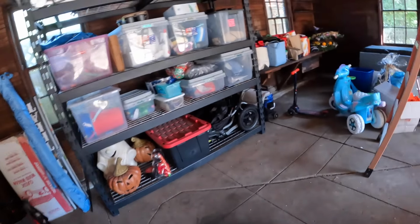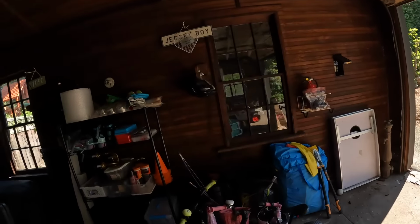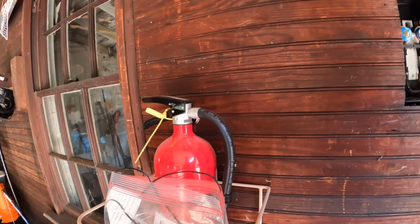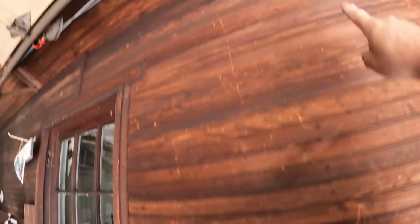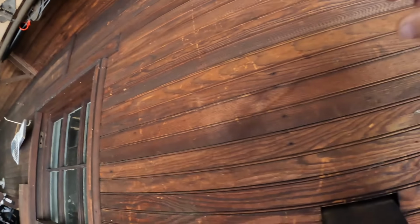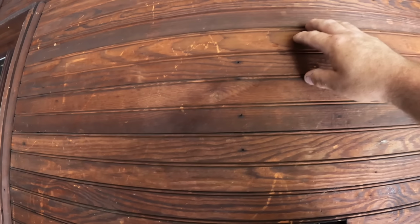And I think what we're gonna do too, since these receptacles nowadays have to be GFCI-protected, maybe I'll put my start box a little bit lower right here. We'll come up and we'll 90 across before going up to the first garage door receptacle. This way we can have an accessible, readily accessible GFCI right here.